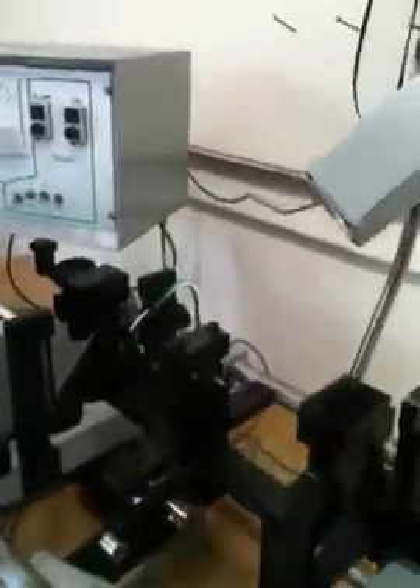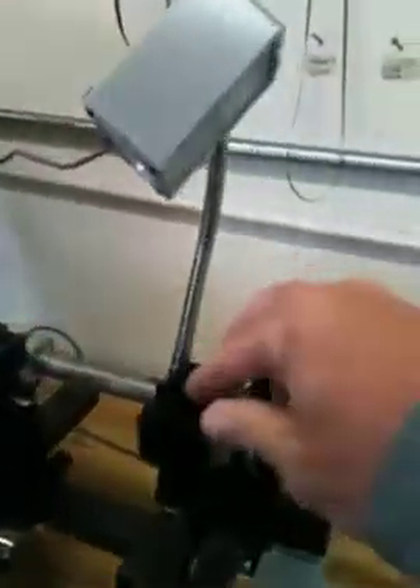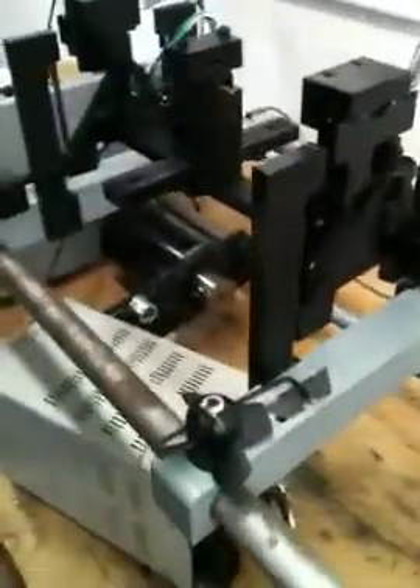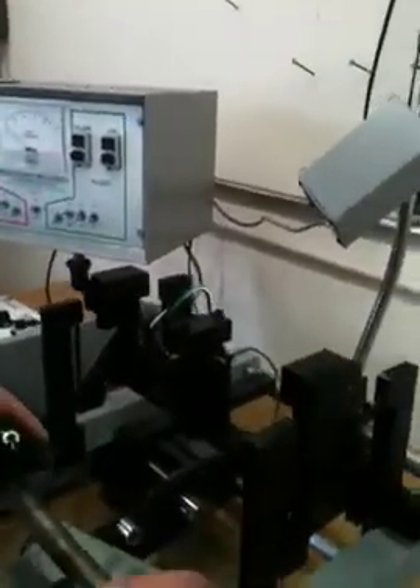Hi, Jay. This is how your motor is mounted into our balancing machine with this cradle. It's free to shake back and forth. Take the part we have here. We put a small mark on it for a reference mark. We go ahead and mount it onto the motor.